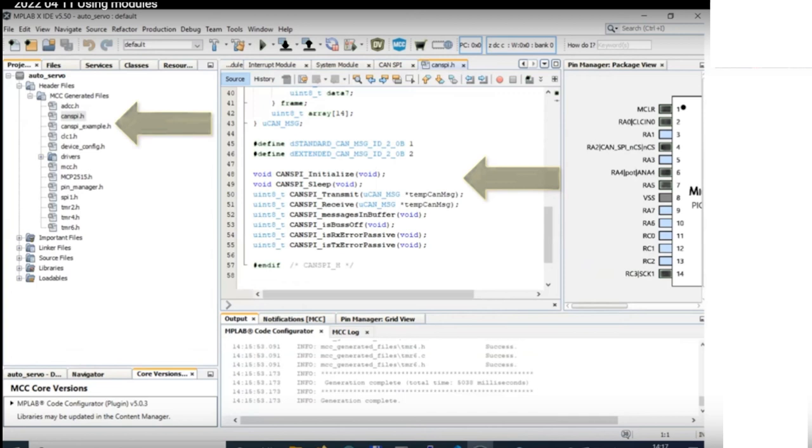Now, this CAN controller is just the standard MCP2551. But think how long it takes you to rig up a development board with an MCP2551 on it, terminate it and make sure it's working. And the 2551, I've noticed people saying, is notoriously fickle. They've got a great habit of destroying themselves. They don't like static. Whereas here, you pick the board up, push it into the socket, press a couple of buttons, and there's your example, and you're off to the races.